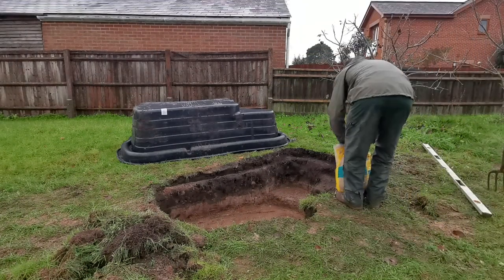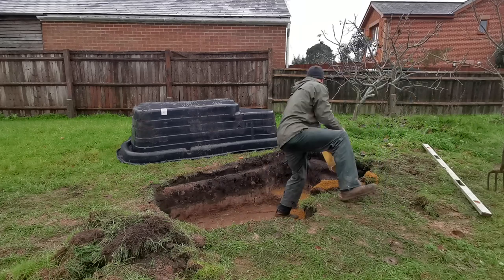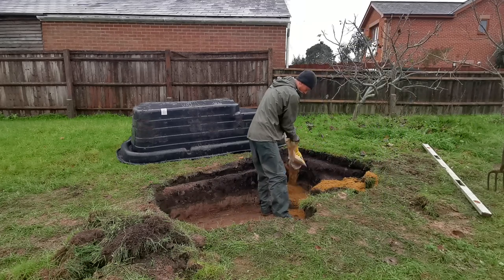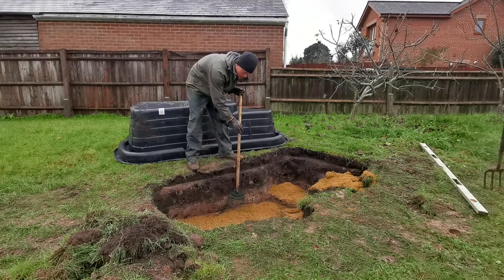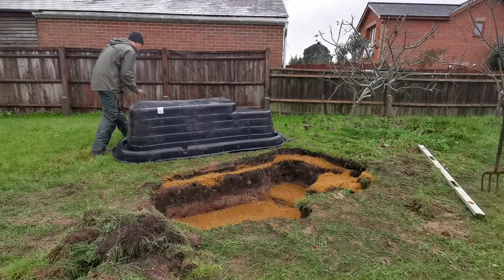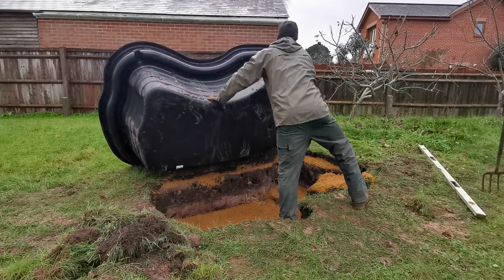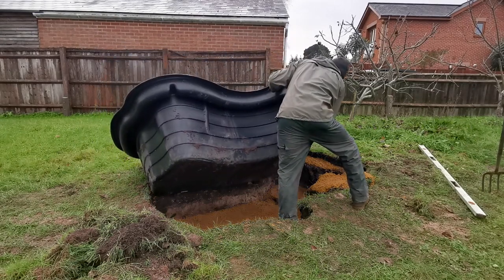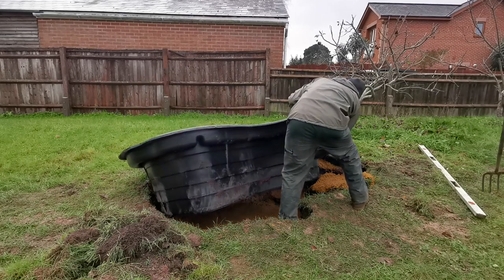After that you're ready to line the base and shelves with sand and install and level the pond. When you put the sand in you can use your spirit level to screed over the sand — pulling it back in a level motion — to make sure the base and the shelves are nicely level. Make sure the base and shelves are firm and there are no air pockets. You can test this by gently banging the base to hear for a hollow sound.